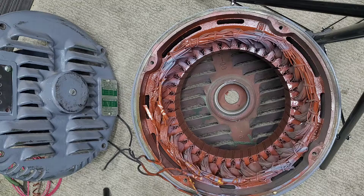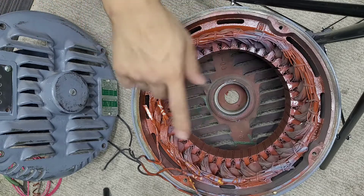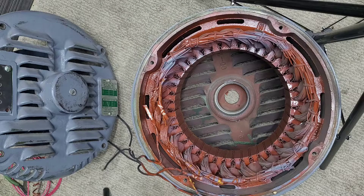I didn't know a whole lot about three phase motors back at that time, but now with the knowledge I have on these, I know that for a three-lead configuration on a three phase motor like this there are really only two ways it could be internally set up. You could either have these wired as a delta or a Y configuration on the inside of the motor. Since this is wired for the higher of the two voltages, I figured it's probably set up in a Y configuration.